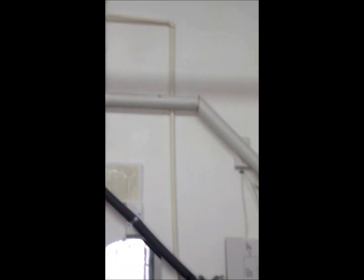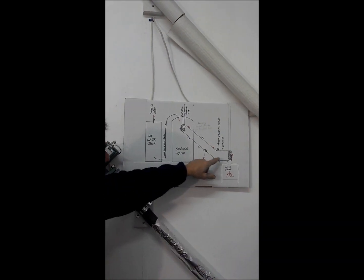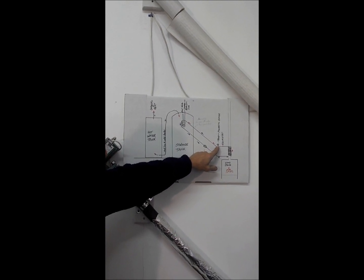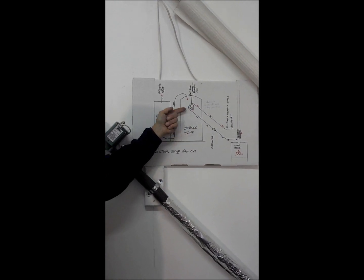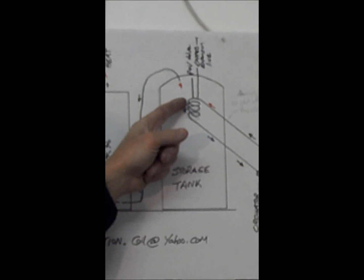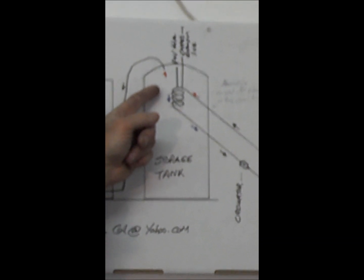Here's a schematic I made up — I'm no artist. Here's your wood stove. Here is the copper coil. The line feeds out — there's the aquastat, it controls the circulator, and the temperature and pressure gauge next to it. The hot water is climbing the coil as it heats. I fed it into the secondary coil in the Stiebel tank in reverse — normally you'd put the hot water in the bottom of the coil, but I fed the hot water into the top. So as it's traveling in, it's giving heat off to the storage tank, which in turn cools the water inside that coil; now it's sinking because cool water sinks, and it sinks back down, driving this system.